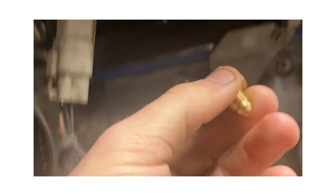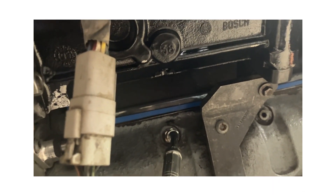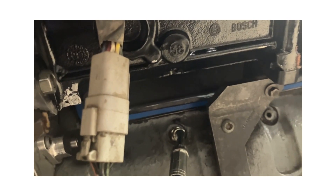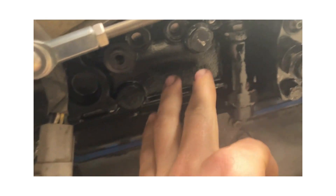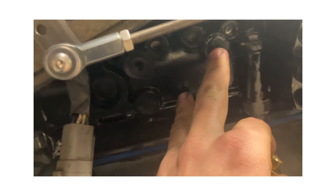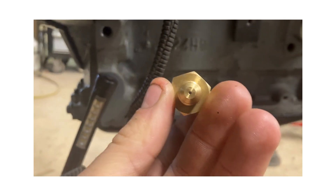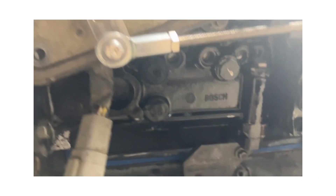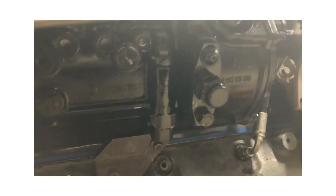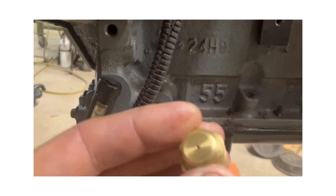They want you to run a restricted flow on the driver's side because the passenger side already has restricted flow right in the pump casing. This one here goes right into the sump of the pump — you can see the crankshaft right through this hole. The only problem with doing it this way is you're restricting the oil flow, which you need to do, or else the pump will fill up too much and flood the governor housing.